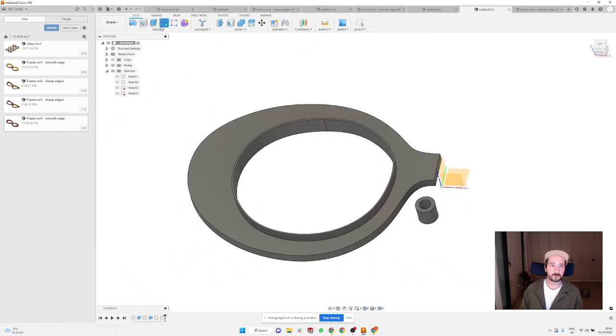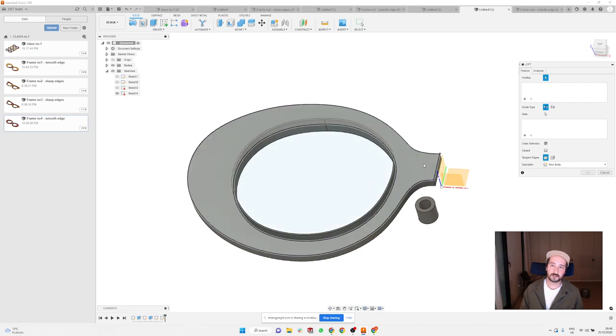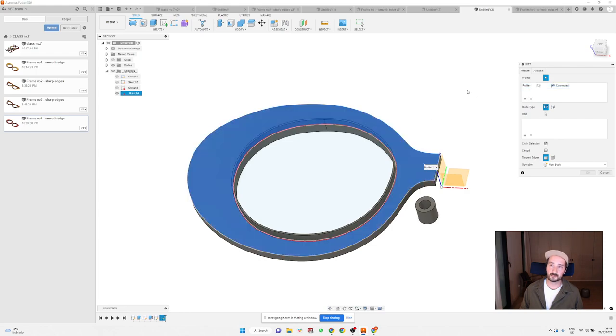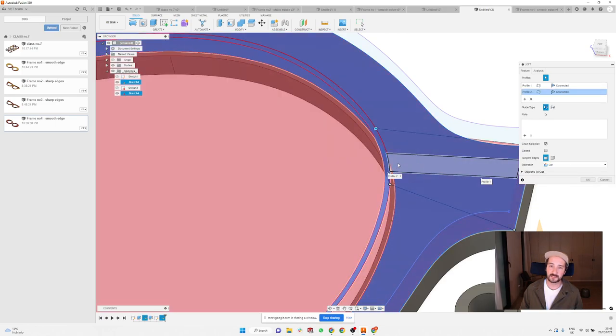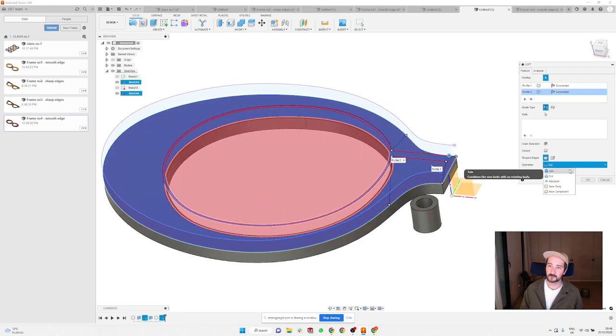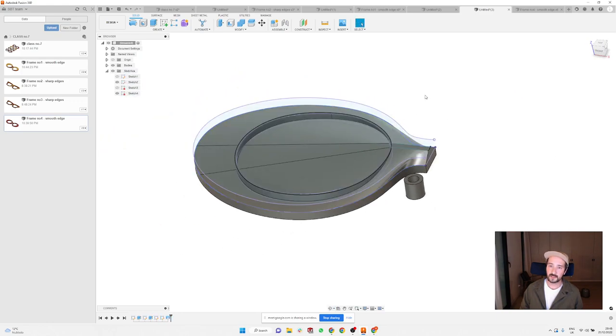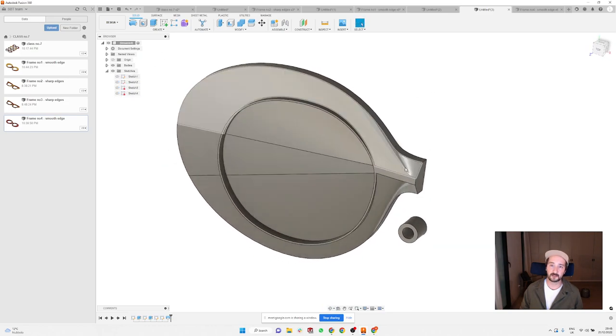And if I now go back to here, loft, I'm going to make this sketch visible. So I'm going to click on the sketch I created before, then click here plus and make this second sketch visible. And I'm going to select this little circle plus this little bridge between those two surfaces. And I'm going to press here join, and it's going to make this transition slightly nicer with a still thick bridge.